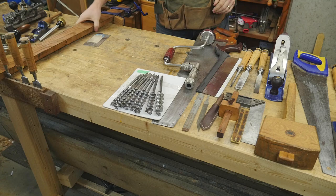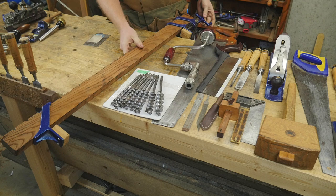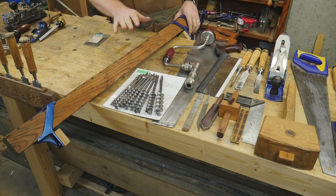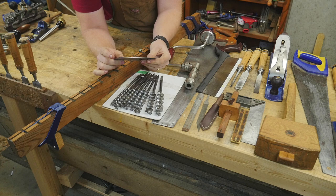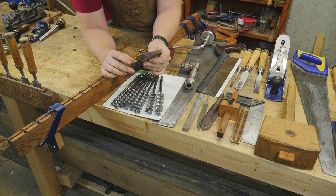The next thing I'd suggest getting are clamps. You're going to need all different types, but the ones I probably use more than anything are bar clamps. The aluminum ones from Harbor Freight are the best bang for the buck. These classical clamps are fantastic — I really love them. I also often use C clamps and traditional screw clamps. Don't worry about buying a large set of clamps right off the bat — buy them as you need them for projects. Also at this point, I'd say a card scraper. You can make these out of old saw plates, and a card scraper is a fantastic tool to have.